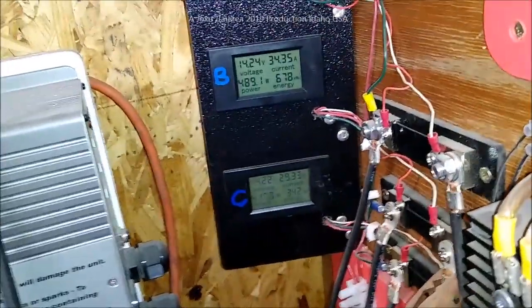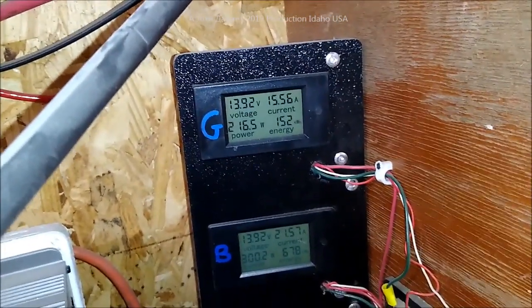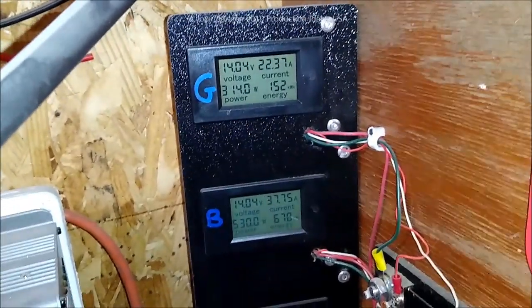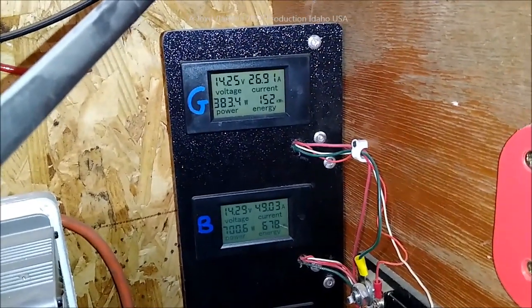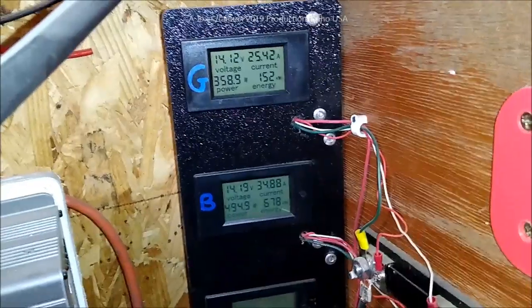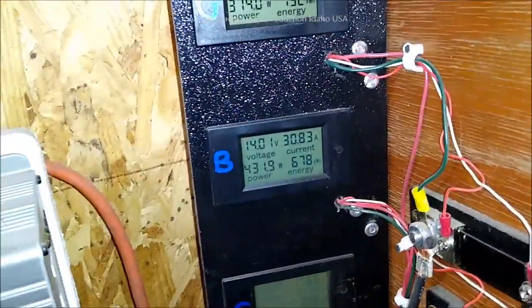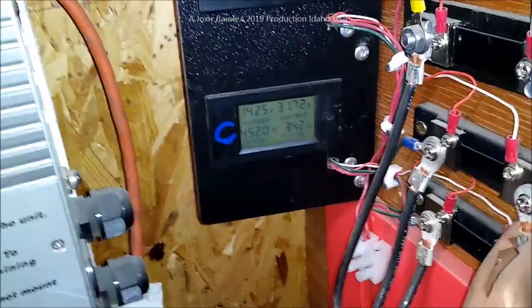This is the 800 watt BNC turbine. The silver turbine up front is the one sending all that prop wash back to the middle one. And when you buy a turbine and somebody tells you it's 2000, 2400, or 3000 watts — man, don't believe it unless you've got the weight of that product in your hands. I can tell you this sucker is heavy, about 75 pounds, and this one up here is almost 50 pounds.